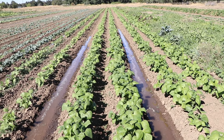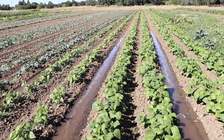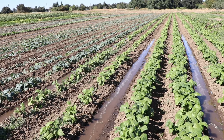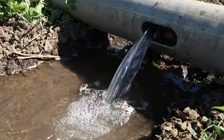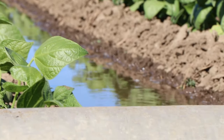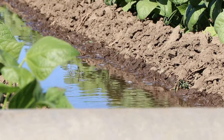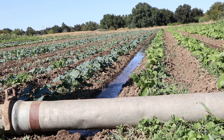This whole process, depending on the length of the field and the soil type, could take several hours to reach the end and irrigate the whole field. It is less precise — there's more water at the beginning of the field and more water works its way into the soil at this end — but hopefully you get the water to the end quickly enough to get a more even distribution.